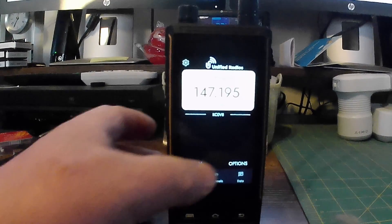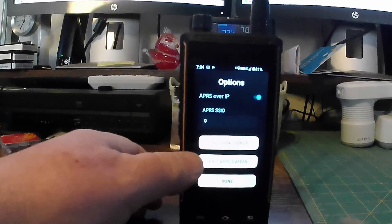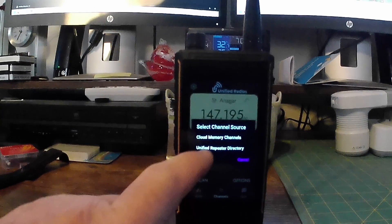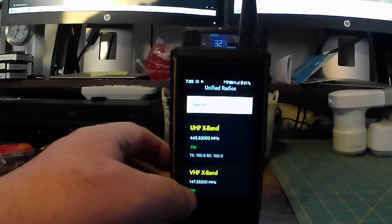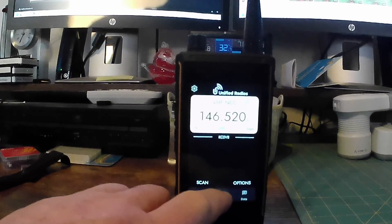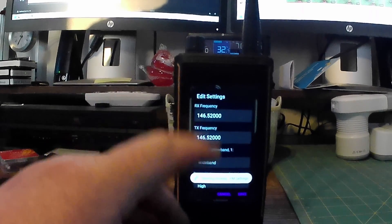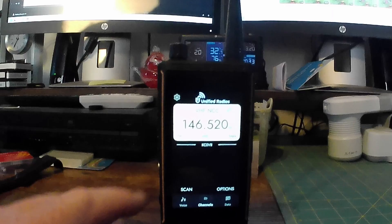The scan function isn't quite there yet. Under Options, this is kind of neat — you can turn on and off your APRS over IP, you can look up call signs, and the exit application is a clean exit out of the application. Remember to program the channel — you can do it three ways: you can use cloud memory which you set up on the website, or you can use the Unified repeater directory. For those two you're going to need some type of internet connection. Or you can go into the standard analog, select analog, and punch these in manually — set your frequency, your wide or narrow band, and if you've got any type of tone control, that's how you set it up.